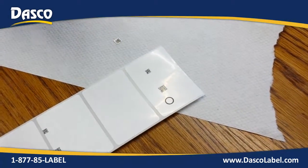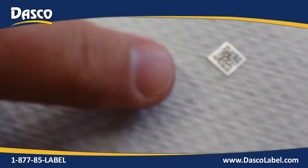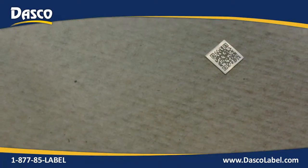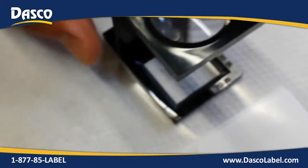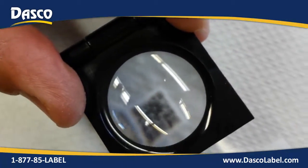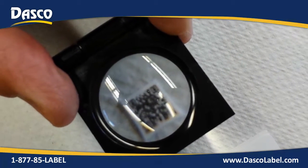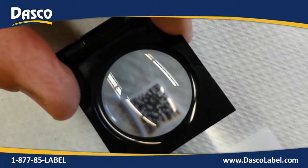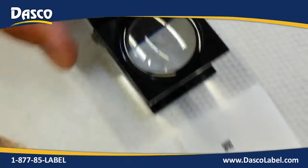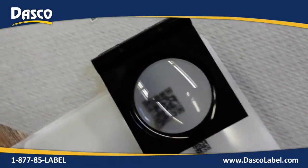Well, I looked at this a little closer. This 2D barcode is really, really dark. I looked at it under a loupe and it just gets quite blurry, because I had the temperature turned up just a little bit on the printer. So what I did was I did the same thing — same exact thing — but just turned the temperature way down on the printer.